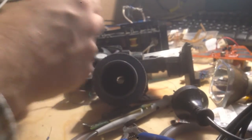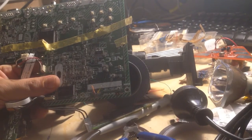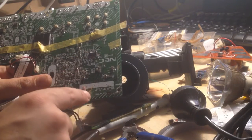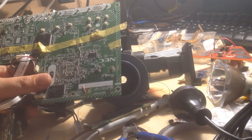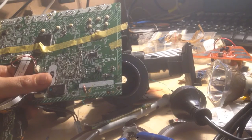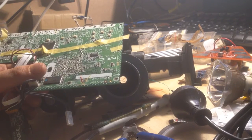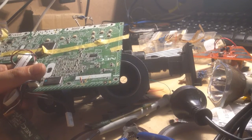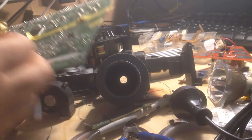I ended up hacking a couple of bodge wires on here and then using the technique that Mike from Mike's Electric Stuff suggests for making a little probe to measure LVDS signals. I've posted some of those to the blog post on this teardown and reverse engineering, but it's going to be an awful lot of work to go through all the LVDS channels and figure out exactly what's going on, so I don't know if I'll do that.